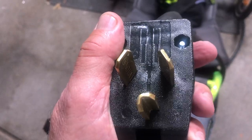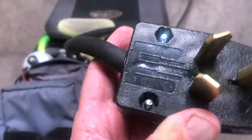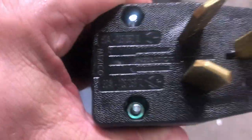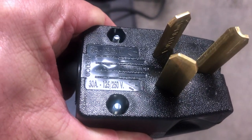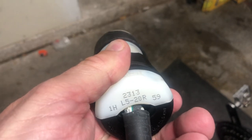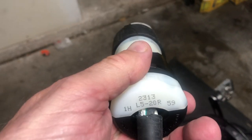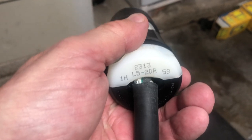My house is older and a lot of the newer houses have four prongs. I know how to do that but I don't have that available. So what I did is I just put this cord in — the black and the red on the two prongs in the front, and then that one on the bottom goes to the common. Then this goes into an L5-20R, which you can get at Lowe's, Home Depot, or Ace or whatever. It's a locking fixture.